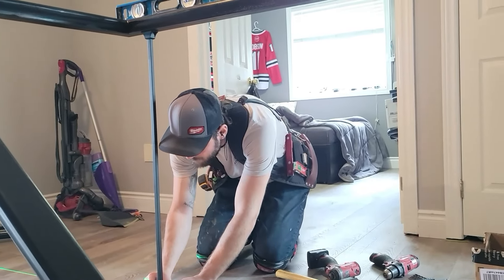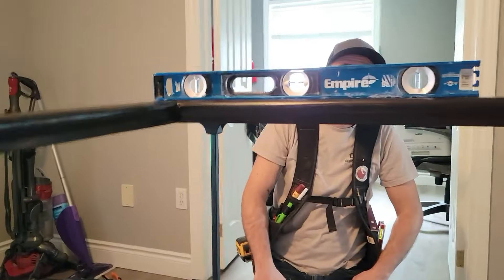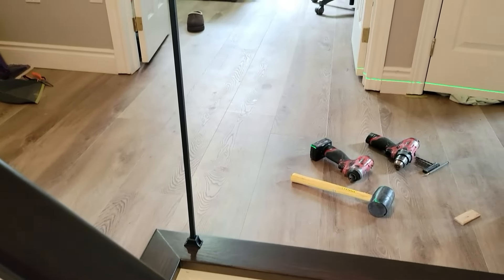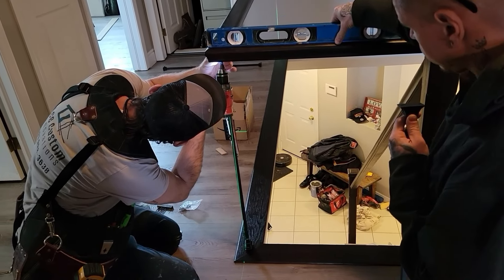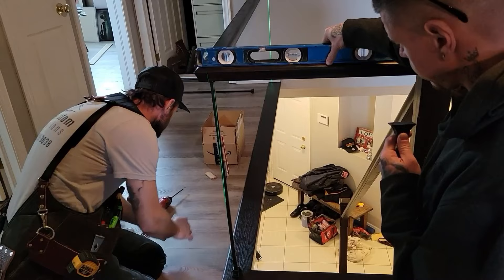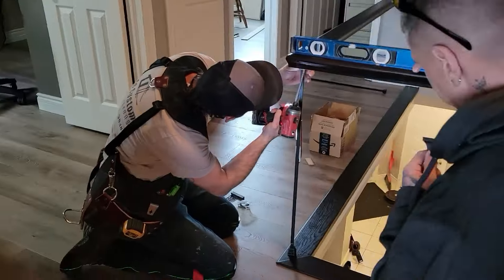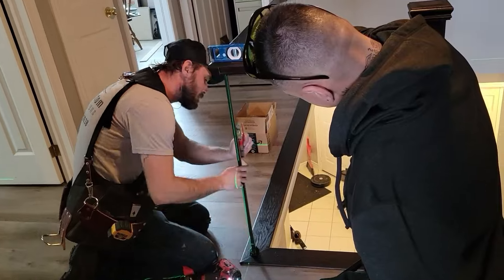Adjusting it left and right based off the level to make sure it's right. Then making sure we're getting it exactly up and down, and checking that leveling at the top to make sure it is level based off of where we've connected that handrail to the wall and to the post. When we know we're all set and triple checked all those lines and measurements, we are ready to go ahead and install. You need to pre-drill the holes — the shoes do come with screws. We start drilling on the top one. This is when you're going to need an extra set of hands to make sure everything stays exactly where you need it. Once those holes are drilled, we're going to use those screws to get those feet into place.